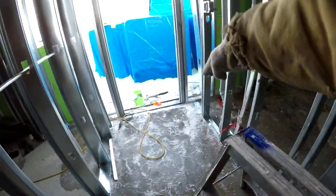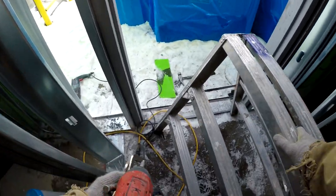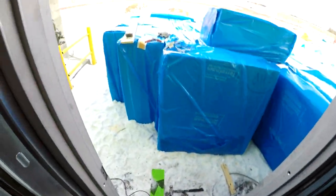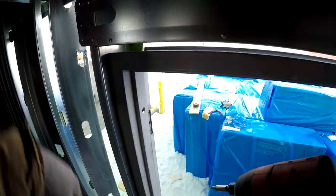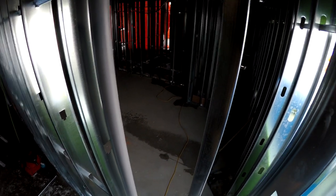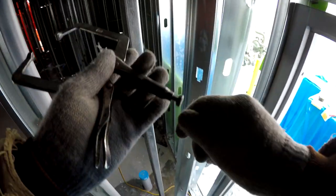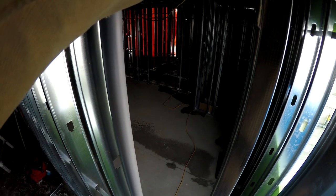Make sure you get the shims under there, pin bolt the inside, same thing — make sure the spacing is good. It's important that you level the hinge side. All I do is set the frame — it's perfectly level — I'm gonna clip the stud at the top, screw it in both sides, and we're done this side. That's pretty much the hardest part. Once you've got the hinge side set and level, it's a matter of squaring it across. It's simple after that.